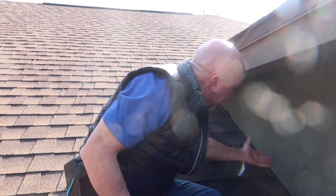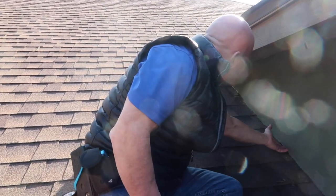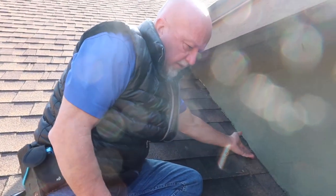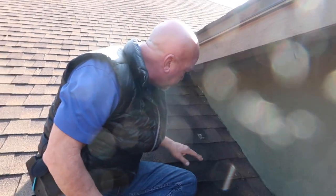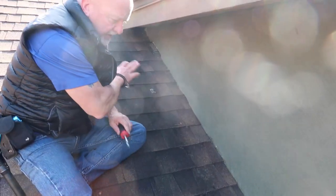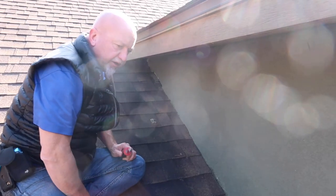Yeah, the moisture is coming from, there's probably some type of compromised flashing detail in this area. Water's getting in along the sidewall. It could be backing up too. So like it hits this joint and then it flows up behind the flashing. So it's getting in either behind the flashing, or it could be getting in through the roofing material somewhere. And then it's moving down, and that's where our rotted wood in the attic is down there in this little